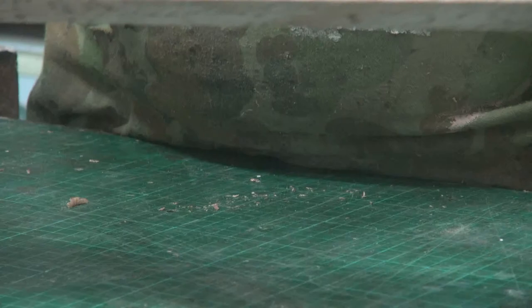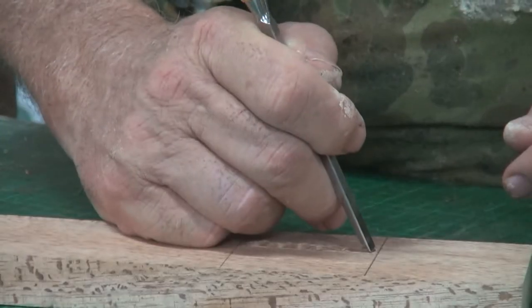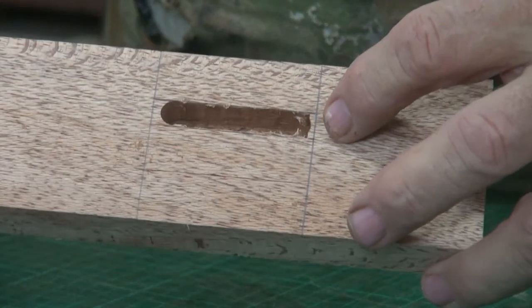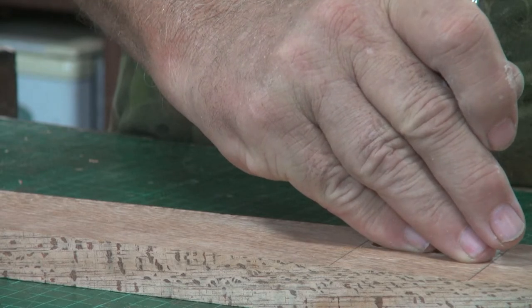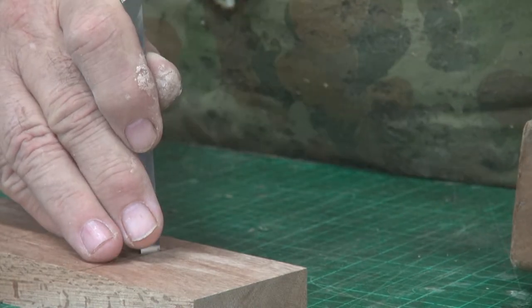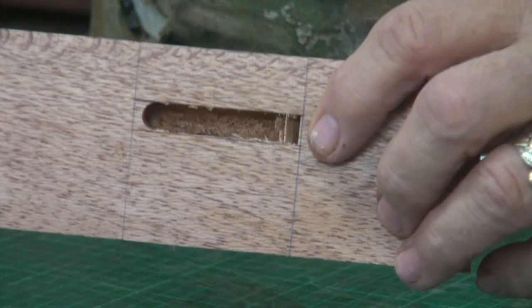All right. Here's one. Again, I'm way past the line. If I put that chisel on the line, I'm going to be absolutely not in a happy place. So what I'm going to do is bring that down. That's my first cut, just before the curve, and I'm going to make another cut. I've halved the distance. I'll halve it again. Now I've taken it to that line.